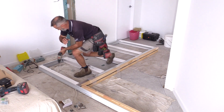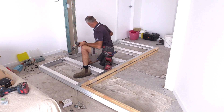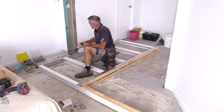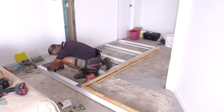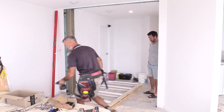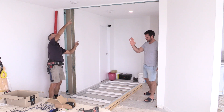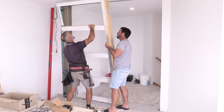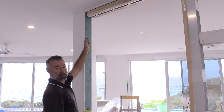Like on all these cavity sliding door frames, while it's down it's a good opportunity to drill out into the back of the aluminium and down to the bottom where your fixing points are going to be. I know where my solid blocks are, so I'll put some holes in the back here and also a couple at the bottom so I can drill down into the concrete and secure it. It's going to sit on those two packers at the base, but we'll have to bring it in, stand it up, and try and get under between here and the smoke detector - it's going to be a little bit tricky.